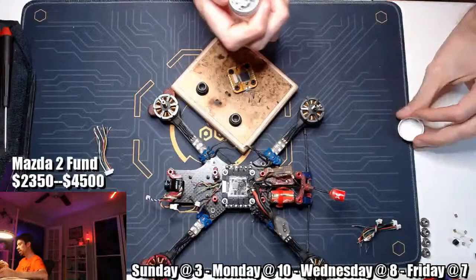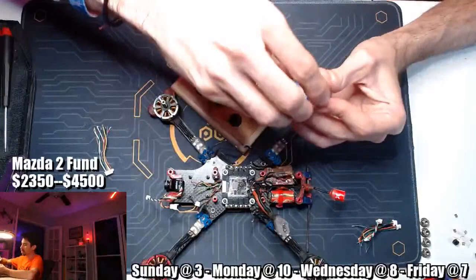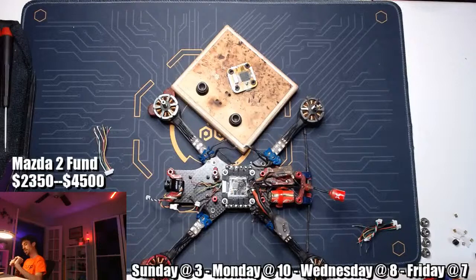This is a strange little thing of tip reconditioner. You can get this or something similar on Amazon. Seems to help a little bit. All right, cool. So let's get to business here. Soldering iron should be 700 degrees. Good to go.